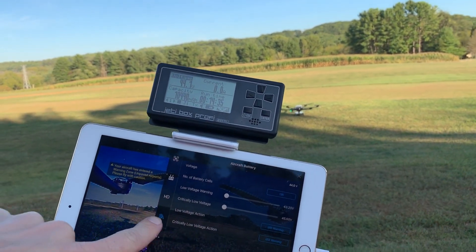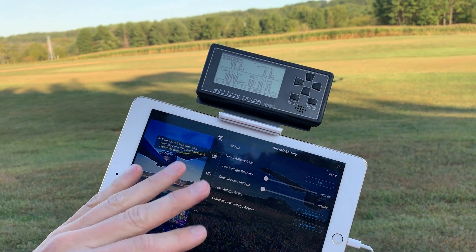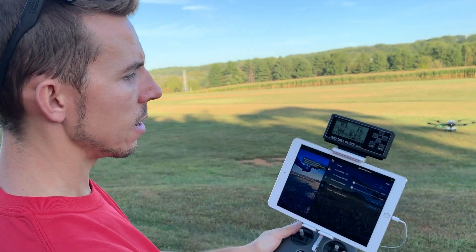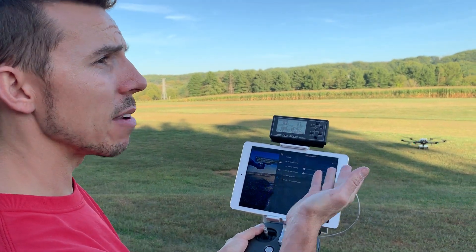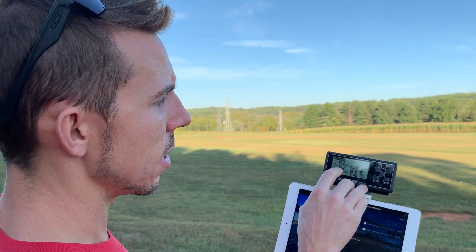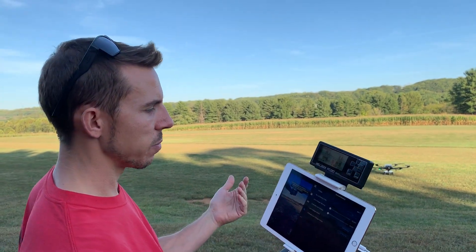Very lastly, in the DJI setup — go to 12S and turn the voltage warning thresholds all the way down if you want to be dead-on correct for your payload and capacity. For example, once you've consumed around 11,000 milliamps and have about 1,000 milliamps left to get home, see where the aircraft is hovering voltage-wise and set those warning numbers based on that. These numbers need to be adjusted per your payload, since different payloads put different strain on the packs. Hopefully that explains it — if you have questions, feel free to email. Thank you.